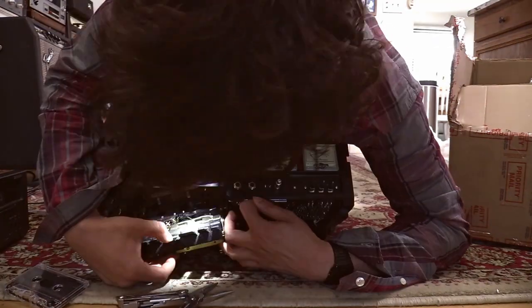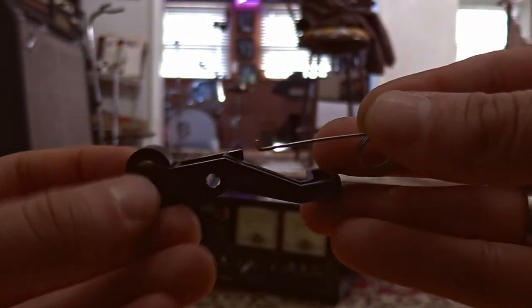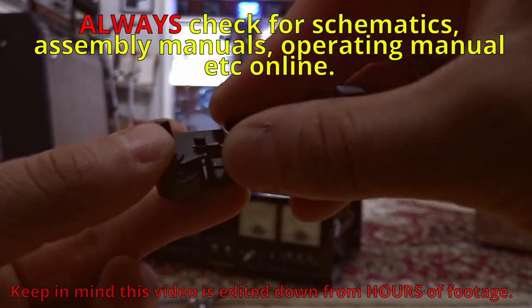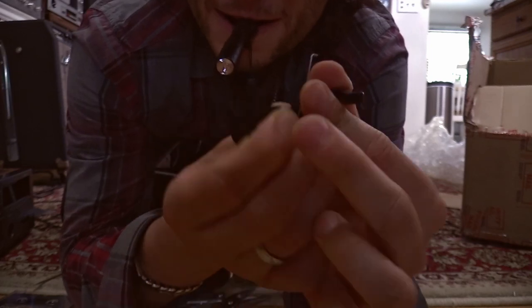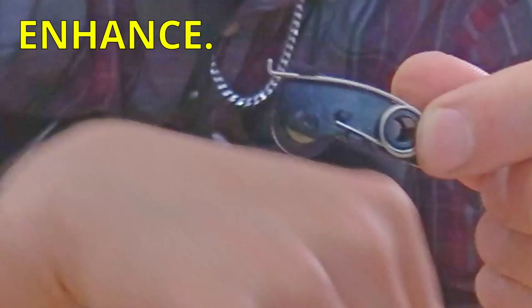The first step was to take the pinch roller assembly out so I could get a better look at the pinch roller arm as well as the spring. This is where a little bit of brains have to come in, because I have to figure out how this piece is supposed to go back in the machine. It takes a lot of head scratching and trial and error. You have to cock the spring and put it behind this tab so it's spring-loaded when you install it back into the transport assembly, and then once it's in position you uncock the spring — that's how you get proper tension.